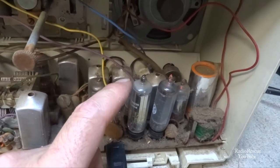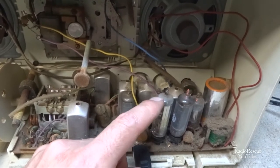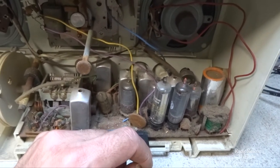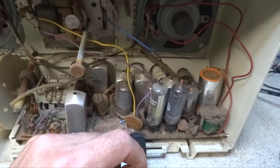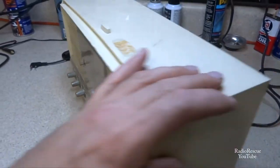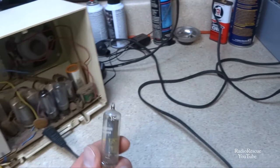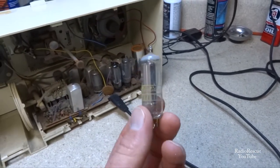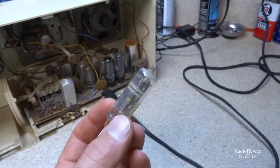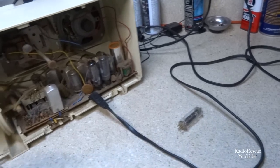This tube here - I don't see it glowing, and that looks like it's gone to air. That's one of those Realistic lifetime tubes, made in Japan. We've got another 35W4 to put in as a replacement. I have never run across a Realistic lifetime tube that was ever any good. The ones I've found that haven't gone to air are always weak or almost dead.